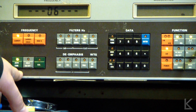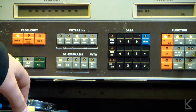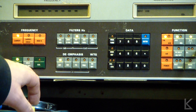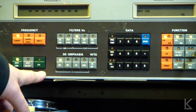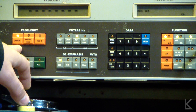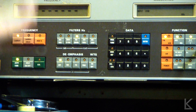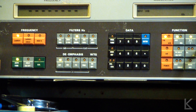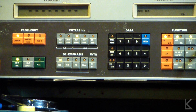Over here you've got auto-tune, where it listens for RF and locks into the strongest signal it picks up, constantly sweeping. Hold keeps it locked on a certain frequency. Calibrate runs it through an internal calibration cycle. The frequency measurement modes are carrier, carrier error, and mod-N, which I haven't found in the manual yet — but basically it just measures modulation. So it's a handy device — I look at it as a very highly accurate frequency counter, a good 10 MHz reference source, and now I have the ability to do deviation adjustment when tuning up a 2-meter mobile, which is really nice.